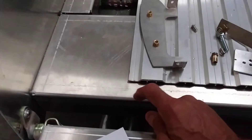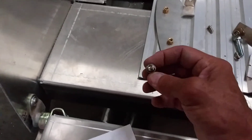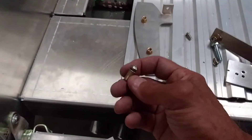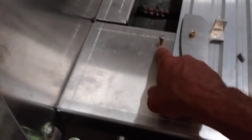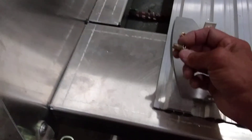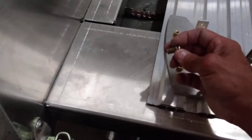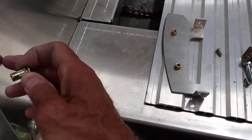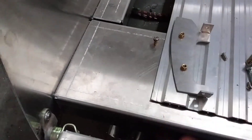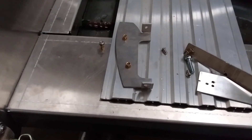So that's the eight millimeter. This is the 10-32 rivnut, the smaller one for these tiny socket head caps. The smaller one is an 11/32nds hole, so you're going to drill an 11/32nds hole for your smaller rivnut. Double check that — if there are small changes to the diameter, you want to drill the hole the exact size of the rivnut so that it pushes in pretty tight. Remember, this is aluminum, it's pretty soft. You can wiggle the drill and really easily open it up, so always err on the small side when you're doing rivnuts.